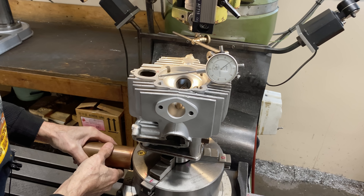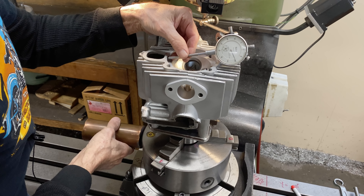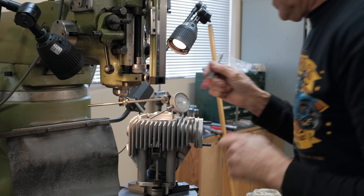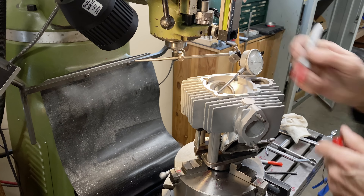The head is now held in the fixture - let's go to the mill. On my particular mill I can't move it because it's in gear, but if I take a quarter inch rod and put it in the shift lever between high and low, now I've got neutral. I needed to zero the head - I need to know it is perpendicular with the mill table. I'm at zero here, and if I lift this up very carefully - a thou. I can live with a thou. You go back and forth making adjustments, and when you're happy you say okay, we're good. Now I'm going to set up the rotary table because if the head's at a small angle and I've got an end mill going around, it's not going to be perfectly flat. You need to be accurate on engines.